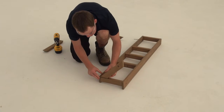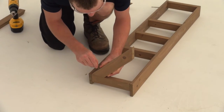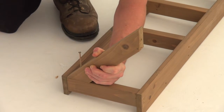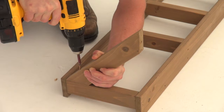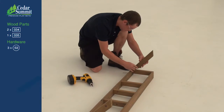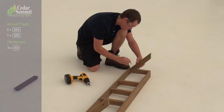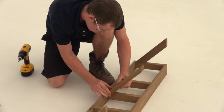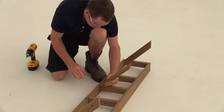Place a counter brace tight to the bottom of one of the counter joists on the assembly. Make sure it's tight to the bottom edge of the counter joist but not overlapping the counter front. Attach with one wood screw. Repeat to install a counter brace on the other outer joist. Then install the counter brace center at the bottom of the center counter joist using a wood screw. In the correct position, it should be parallel with the counter braces.